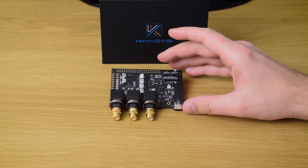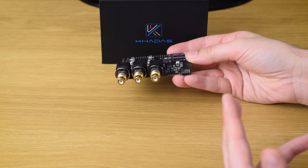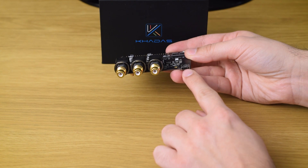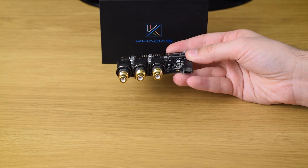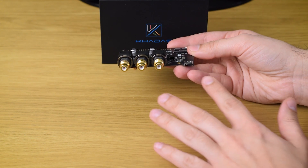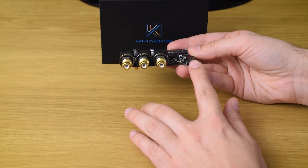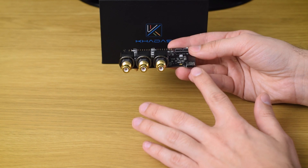As you can see, you receive just the board in the package, without any casing. But it is a completely functional DAC device out of the box. We have all needed inputs and outputs for it to function properly. First, of course, we have line-out. There is also a coaxial input, and a USB input, with USB doubling as a power source. You don't have any means of switching inputs — USB is a priority input, and if any audio signal is detected, the DAC will prioritize it over coaxial. Coaxial input will turn on only if it receives audio signal while USB doesn't. For example, if you're using USB just to power it, connected to a power brick, you can use coaxial.